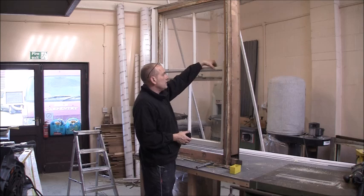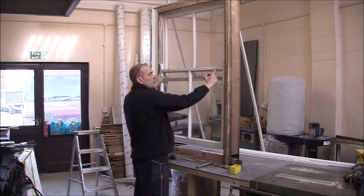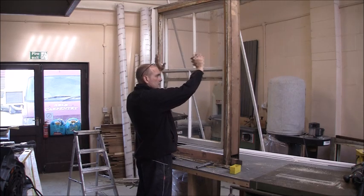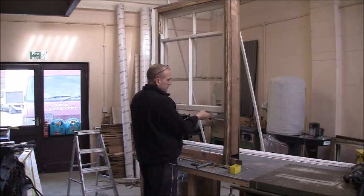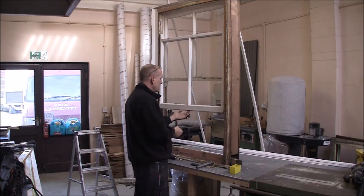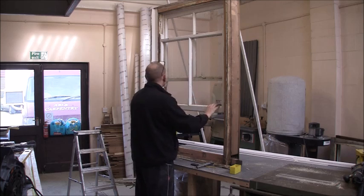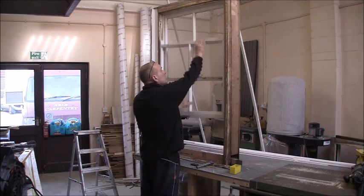I've fitted my brush in here, I've trimmed it to the length, I've got a couple of panel pins in, approximately this distance from the ends, just to hold it, just in case the adhesive stuff ever fails. The brush is in the bottom here as well, and exactly the same, but being in the bottom, I've never had an issue with it, but it seems sensible. I put a pin in the middle here, and a couple of pins towards the ends. That way, it's just making sure, really. That's in. It moves.